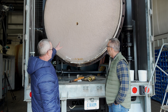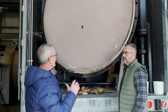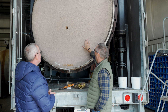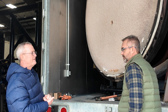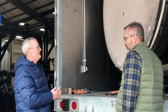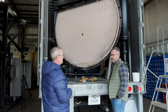Another thing — this is a prime example — you can see a few hairline cracks in here. Don't worry about it, leave them alone. If you try to V that out and fix that, all that's going to do when that door heats up is it's going to swell, and when it swells up it's going to kick that patch right back out on top of it. Leave it alone. When it heats up, it's going to seal that crack completely off — you won't even know it's there. When do you actually work on that crack? It has to be three-sixteenths to a quarter of an inch wide. And when you see discoloration in the metal in the back door, your heat's going all the way through it — it's time to do something. But it needs to get pretty bad, because that refractory will swell up a ton and it seals itself off.